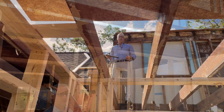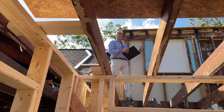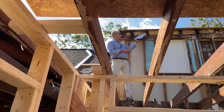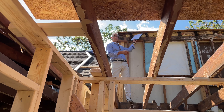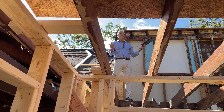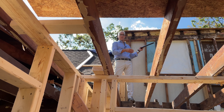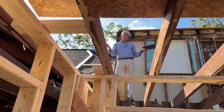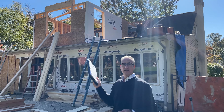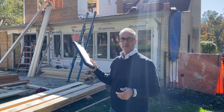So I'm up on the roof and I wanted to show you that we exposed the whole existing hall bath that was up here. We're going to get rid of this rotted top beam and replace it. We're taking the roof off, and because we're putting a new roof line higher for the new office, we're actually going to give them a cathedral ceiling in the bathroom — so sometimes you do end up with something pleasant and unexpected. All of our wall framing is up and we're getting ready to put our roof rafters on and the roofing shingles.